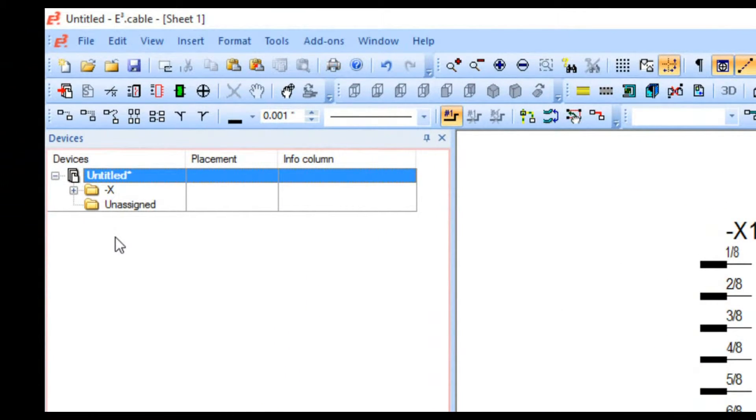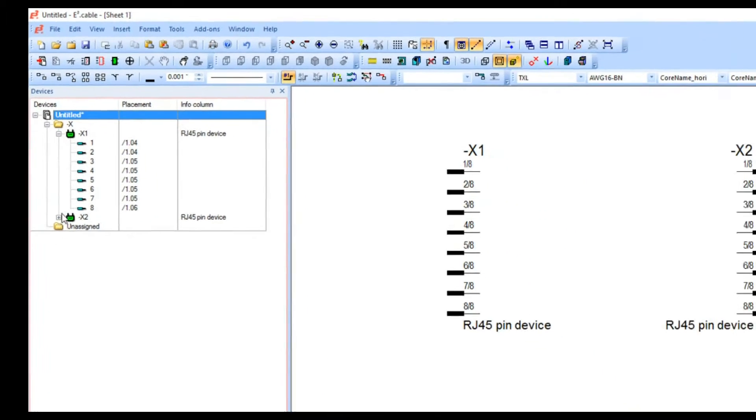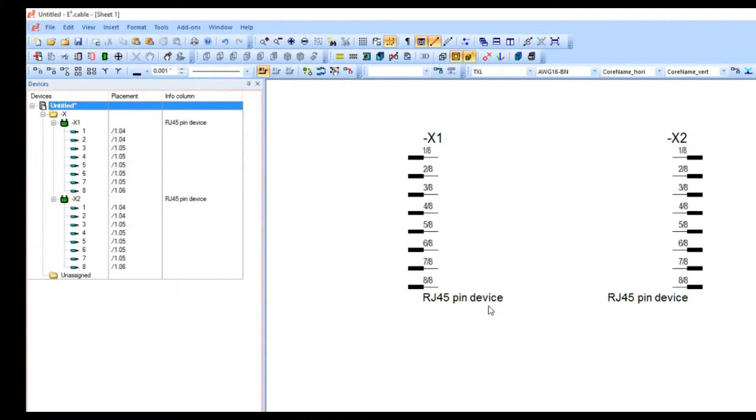So if I had a bunch of other designators you'd see folders with A, C, or W depending on what components I was using. In a large design with maybe 40 connectors, I'd see all 40 listed under X. But for now we see only X1 and X2, and we can expand those out. In addition to my symbolic representation, I want the physical representation for X1. So I'll click on X1, right-click, and say place the master symbol — I place that down, and you'll notice it also says X1, meaning I'm not creating a new part. This X1 representation is associated with the X1 representation on these pins.